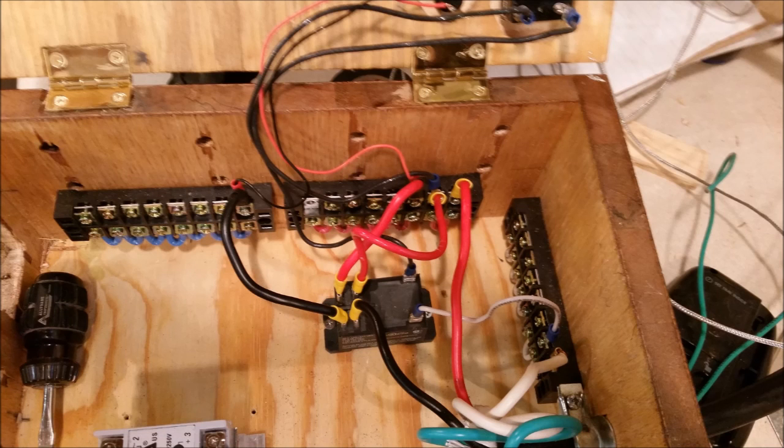Here you'll see me starting the wiring process. This is the main power relay, and you'll notice I used squeeze-on disconnects and spade terminals on the wires. I also soldered the connectors to the wires so that they wouldn't come undone. Also, because this is for the most part 10 gauge stranded wire, you have to solder it. Even the solid wire that I had used in other things here, I soldered them to the disconnects too.